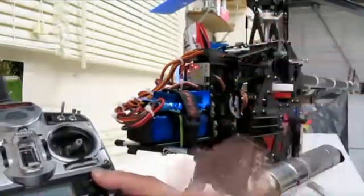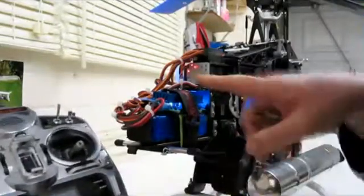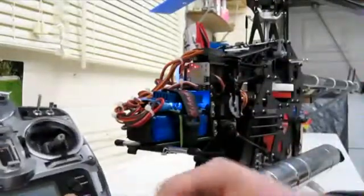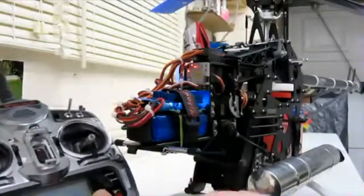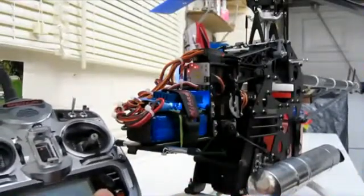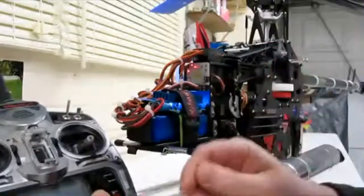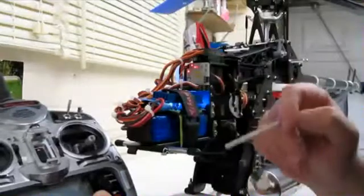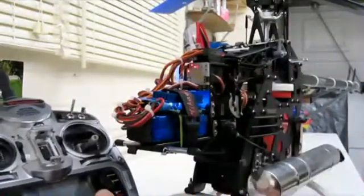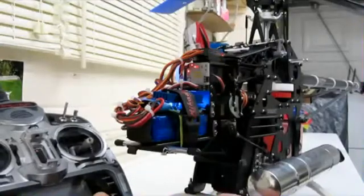Another tip: when you turn it on you get the flashing sensor light, and you should be able to put the starter coupling in and wind it over a couple of times for the magnet to see. The way you get over that is just pressing the set button once and you go straight into the governor itself. One other last tip: sometimes you may get engine RPM hunting. If you're using the remote facility, this adjustment pot becomes the gain adjustment. If you've got a hunting of RPM, you could try turning the gain up and sometimes that will get rid of it. Obviously if you've got any other problems on the helicopter, the RevLock will tell you you've got a problem — it won't mask it.